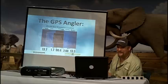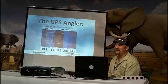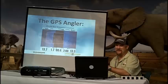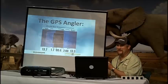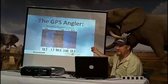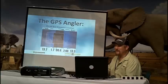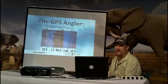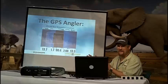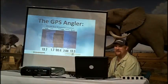It's going to fight my fish tape again getting my transducer cable up. I hear people say they want to put their receiver underneath the deck. You just bought a $1,000 to $3,000 unit — and you want to skimp and put the receiver under it? What I tell people before you do that: turn your GPS diagnostics view on, plug your receiver in and move it around the boat. If you can put it up under there and you like it and you get good reception, do it. I want mine to get the most accuracy — because that estimated position, the number of satellites at different times, are going to change. The more precision you can have, the easier it's going to be to get exactly back on.